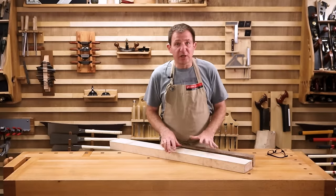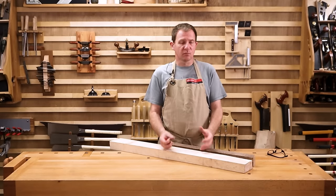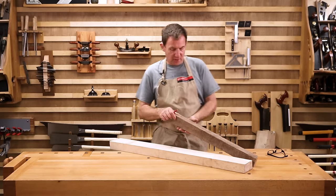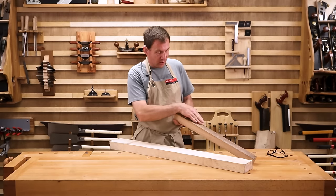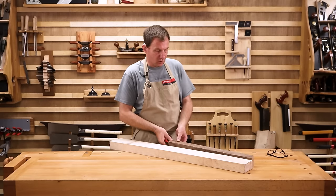Having given you a bit of a guide of materials, how they're going to shrink away from the centre, how the boards will cut, we've got that selection. So my bit of sycamore, we've got a few things here, we've got the bit of oak. Now I know on this oak edge, we've got slight taper coming off towards the edge here, so it's not square. This is rough sawn. I can feel it's also got a little bit hollow, even across that narrow width. So that's going to cause a few issues.